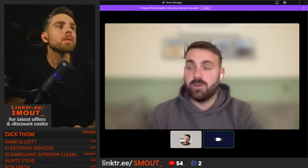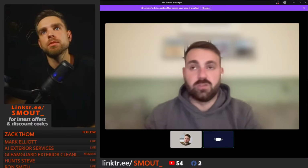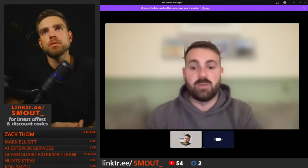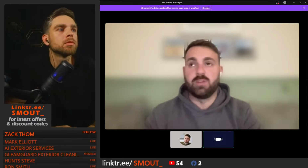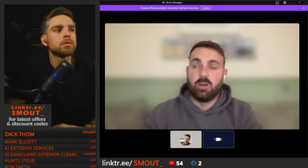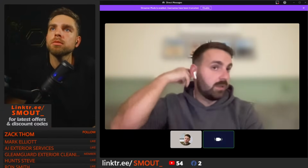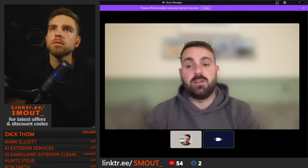To be fair, it was quite straightforward. It's like a 70 attached on the first one, flat tile. So once you've got the scraper blade on it, you literally just run it across underneath, like the underbelly, and it just drops off like it's heaven. So we literally smashed through that in like 2.5 hours. One was at the front, one was at the back. And then we had another one, which was a profile tile. It wasn't too bad. The back was really bad. The front wasn't too bad. And that took us like 4 or 5 hours. So yeah, whacked out 2 in a day.